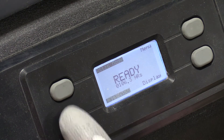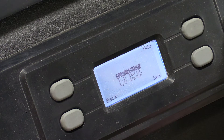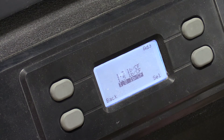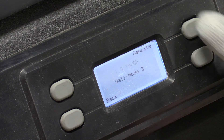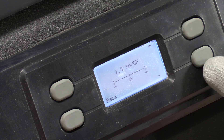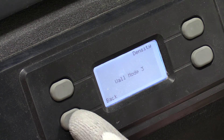To select wall mode on your ProCat machine, press the button indicating wall mode. To view the preset density modes, press the button indicating menu. To change the density to another setting, press the button indicating select. To fine-tune the currently selected density, press the button indicating adjustment, then press the same button now indicating density. Here, you can increase or decrease the preset density using the plus or minus buttons. Pressing the back button automatically saves your settings.